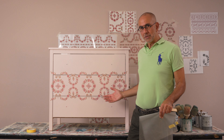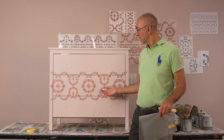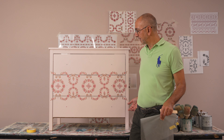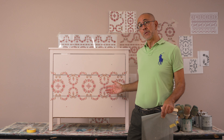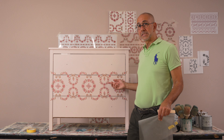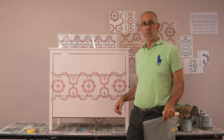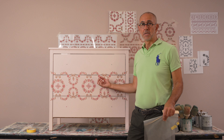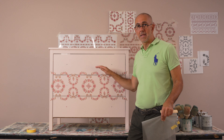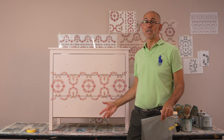This is the result once we take the film off — it laid out perfectly. There is still one step: we need to cut off the pieces that overlap onto the drawers. We can do that with a simple knife and then overlay those pieces within the border of each drawer. Then we're done with this strip and can move on to the next one.